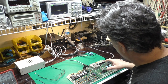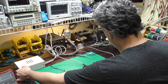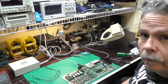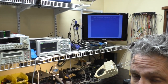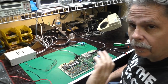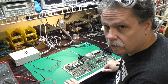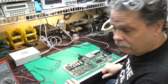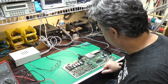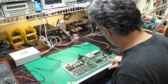I've got the 8701 clock generator from the Commodore 128 installed in this board. I'll turn the power supply on — and there we go, it comes up now. So indeed the crystal is okay. We didn't see a big difference between a good crystal and the one on the board like we did with that Commodore 128; it was just that our clock generator chip was bad. I'm going to keep this 8701 from the 128 in here until I can make a replacement for the Commodore 128, so we can get this young man a working computer.